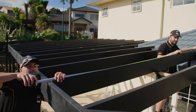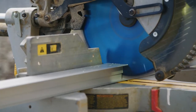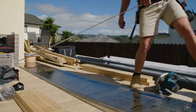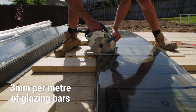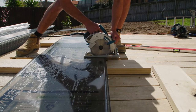Measure the length of your roof and cut the glazing bars to length using a drop saw, circular saw or hand saw. An overhang of minimum 50mm over the gutter is recommended. Cut panels on the reverse side to length, minus 3mm for every 1m of the glazing bars to allow contraction and expansion, using a circular skill saw with a fine tooth blade.